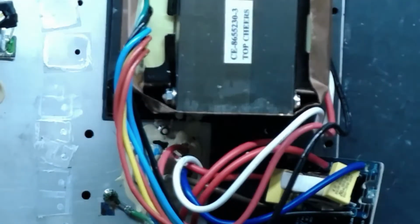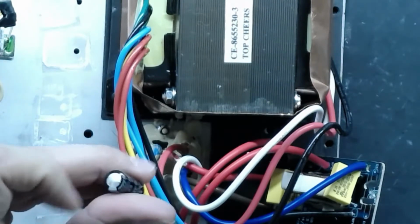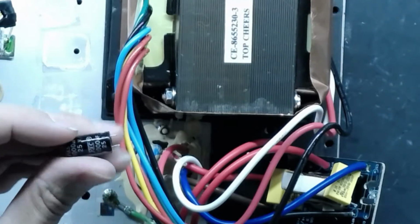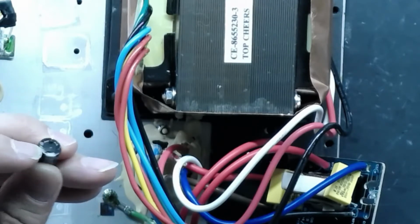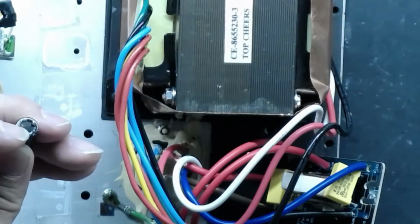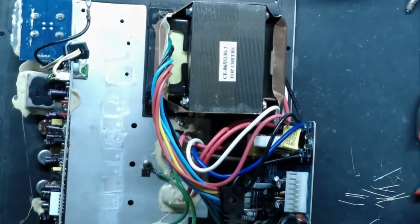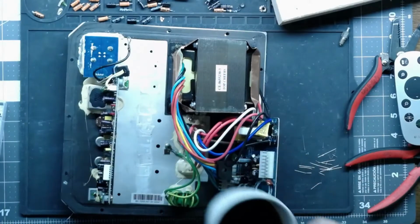And that's one of the things you have to look for when you're working on some of this audio equipment. Some of these things might not be leaking all over the board, but you definitely want to check the tops of the caps to see if they're domed out. If they're domed out, that usually means they've been heat stressed and they're on the verge of leaking. And they don't always leak from the top. Sometimes they'll leak through this little rubber bottom of these things where the legs come through. Sometimes they'll leak and it'll burn the through hole or the pad out. So whenever you're working on anything that's older and needs to be serviced, you're better off just replacing all the caps, because if you just do the ones that are visible, you're probably going to miss a few that are having some issues. So keep that in mind.